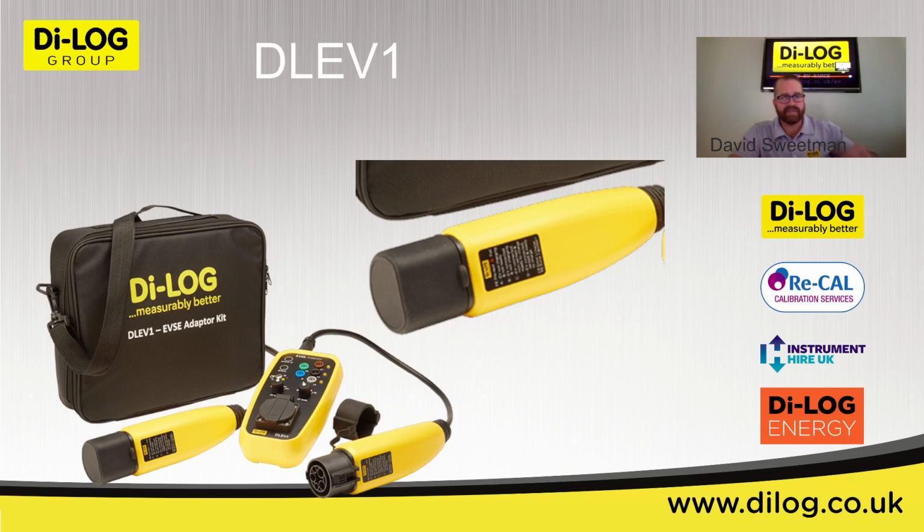But other features on the EV adapter itself, you've got CP error E, which puts the control pilot mode into error, so the vehicle error in effect, and that's just stop and disconnect the charge. You've also got PE error, so if the earth disconnects or becomes disconnected at any point during the charge sequence, the charge will be aborted and won't continue.